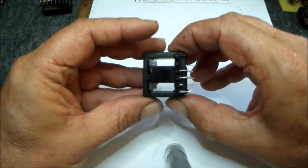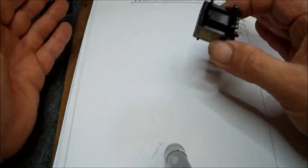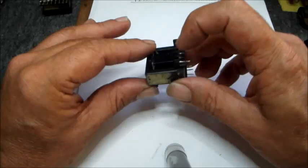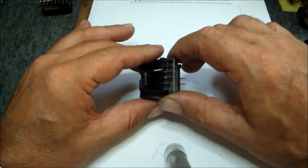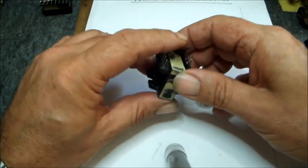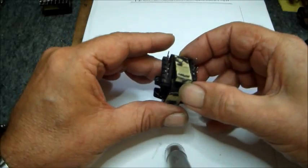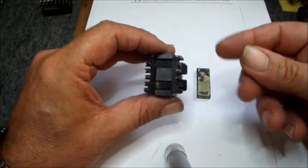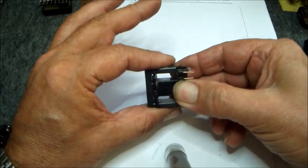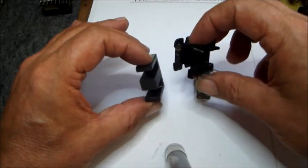First of all, to make use of these types of transformers, you have to heat them up on a lamp first. Just take a portable lamp with about a 60-watt bulb, put the transformer for about 15 or 20 minutes, and occasionally turn it over so it heats up evenly. And then, after taking off the surrounding tape from here, you can easily, or with a bit of patience, put a scalpel here and lift off this piece first, taking care not to burn your fingers. Just take a piece of cloth or whatever to hold the transformer with, and then nudge it out slowly without trying to break it. After that, it will be quite easy to dismantle the transformer.